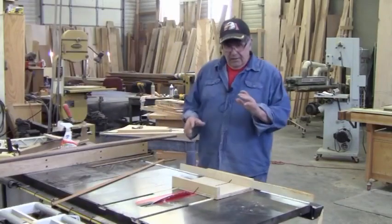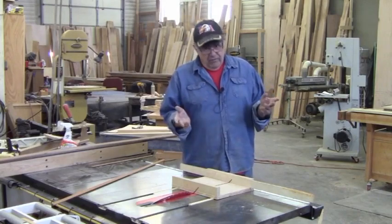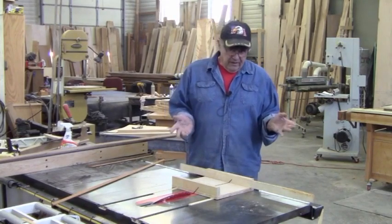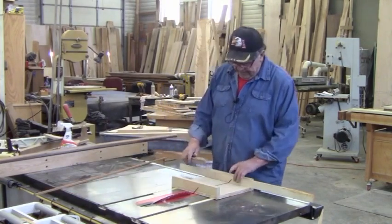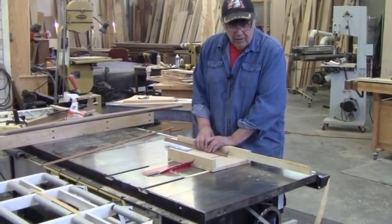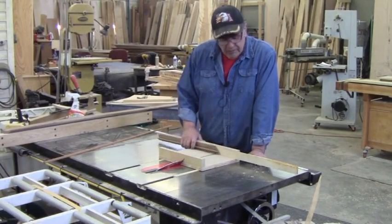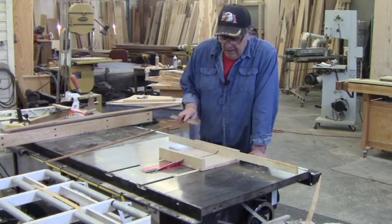Again, because the chop saw is able to lay the crown up and come down, that just works so well for a miter. You would be hard pressed to design something that would allow you to do it on a table saw effectively and easily. But just for straight up miters, picture frames, whatever, they're great. Again, this is going back to our little jig here. Now, if I've got a tall molding like this, then I'm going to run into an issue unless I can get the blade up high enough. Because this was done for just some small moldings, I wouldn't be able to do it.